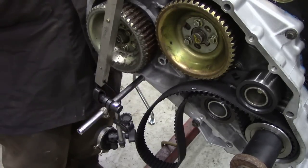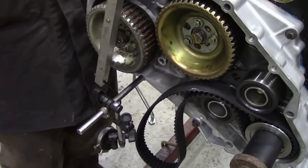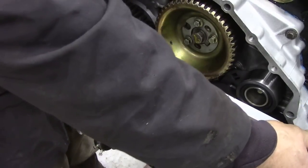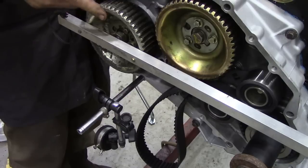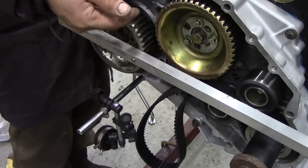Is it supposed to be like that? I don't know. Has that been caused by the bearings? Probably — well, not by the bearings, but a tight belt. Probably. And that could explain why the belt's moving. I thought it was strange when that belt kept moving forward, but it took very little pressure to push it back.